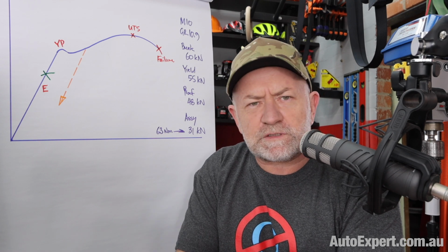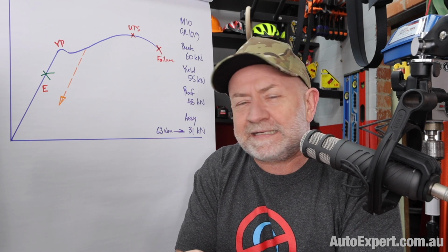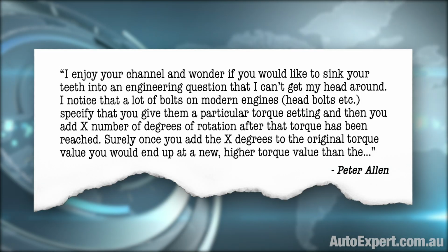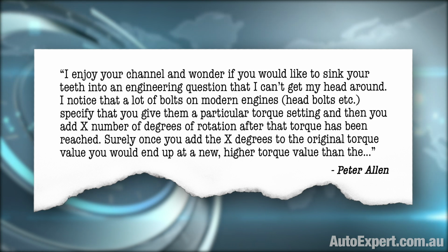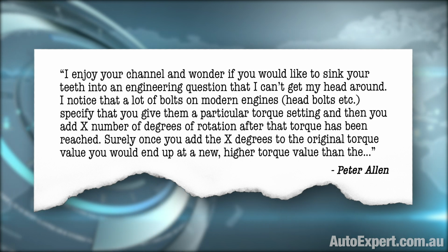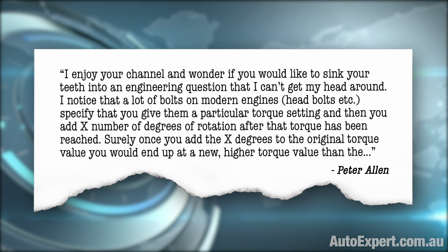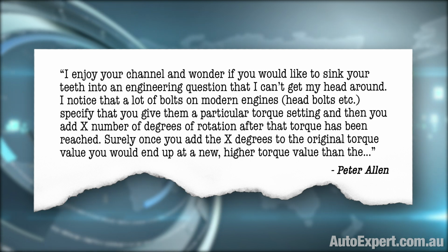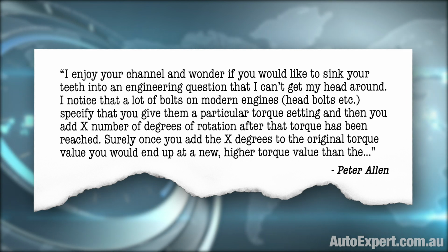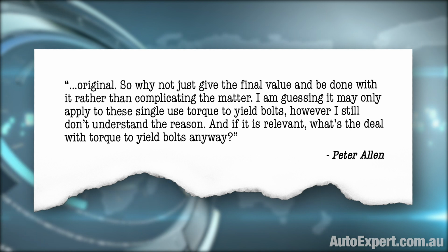This question, which trickles through periodically, I get quite a bit of it from people asking about whether they should actually replace those head bolts or not, comes from a guy named Peter Allen, who says, I enjoy your channel and wonder if you would like to sink your teeth into an engineering question that I can't get my head around. I notice that a lot of bolts on modern engines, head bolts, etc., specify that you give them a particular torque setting and then you add X number of degrees of rotation after that torque has been reached. Surely, once you add the X degrees to the original torque value, you would end up at a new higher torque value than the original. So why not just give that final value and be done with it rather than complicating the matter?